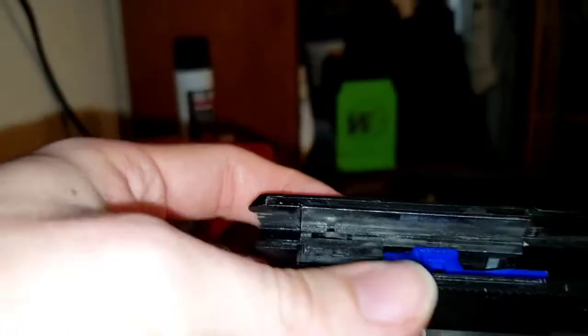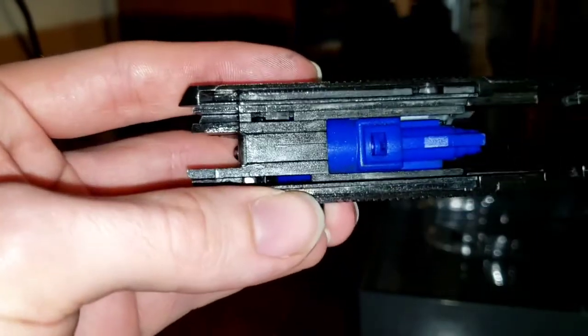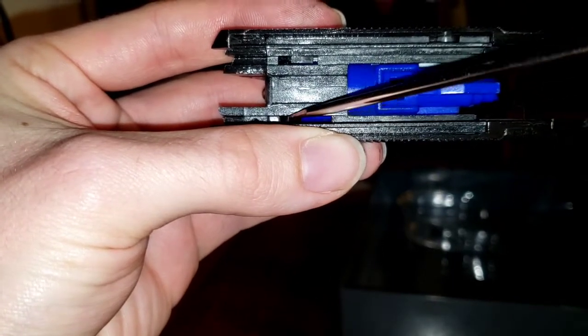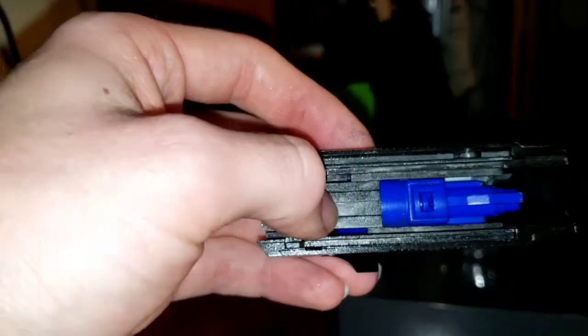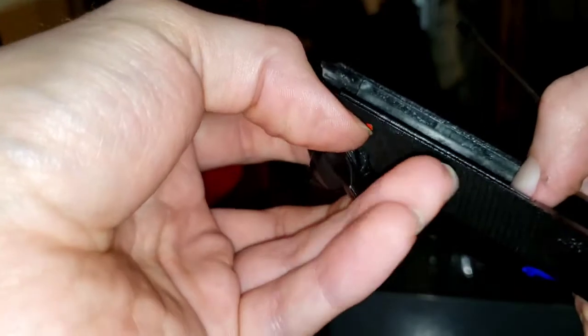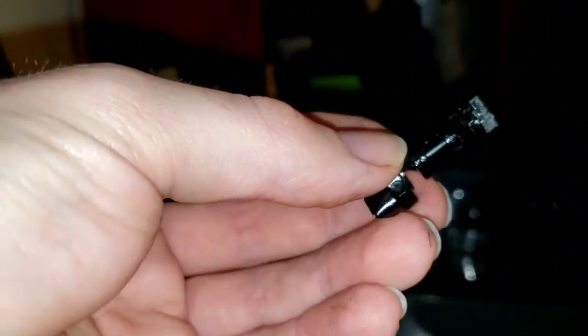In theory you want to pull this straight out, however there's a catch. This nozzle protrudes into the back of here — you see this section right here, this is the nozzle and this is the safety. If you just yank on this, you will damage the nozzle — the back of the nozzle will get collapsed and it has a crescent moon shape to it. So what you want to do is pull this up and pull the nozzle forward — you see how it clears — while pushing on the back here. Push this in, pull this out, and there you go.